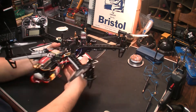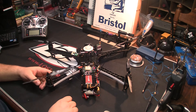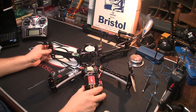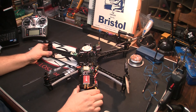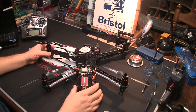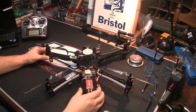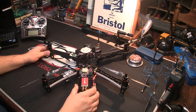That's pretty much my build. Everything in here works great — no problems with interference and great flight times. If we went with 10x5 props we'd get a little better flight time, but I really like these 9x5s for agility. If you have any questions or are building one of these and running into problems, feel free to post a comment on YouTube or send me an email. I've already gone through a lot of the pains of setting one of these up, and if I can help anyone out even a little, that would be great. Thanks for watching.